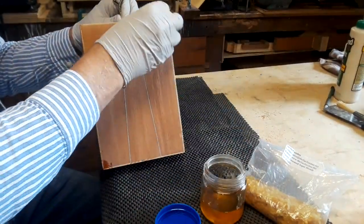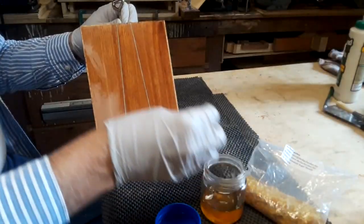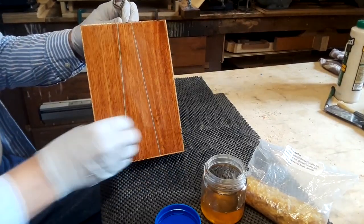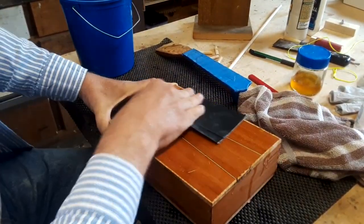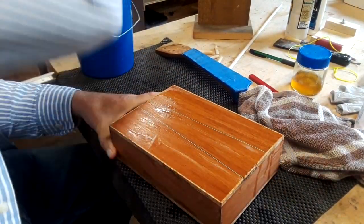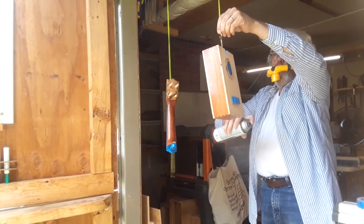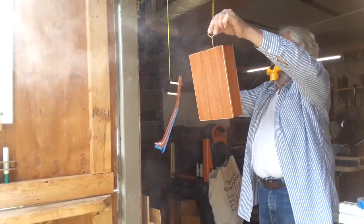At last we're ready for painting and final assembly. Mahogany has an open grain that needs to be filled — I'm going to use good old-fashioned shellac, which will fill and seal the wood before applying the top coat. I mix my own shellac using flakes and alcohol; mix it up, let the flakes dissolve for a while, and you're good to go. For a smoother coat, I wet-sand between each coat with 320 wet-or-dry sandpaper. Shellac doesn't have good resistance to water, so it needs a top coat — for that I'm using polyurethane right from the rattle can. Poly is very hard to keep from running on vertical surfaces, so I ended up spraying only on the horizontal, one surface at a time.